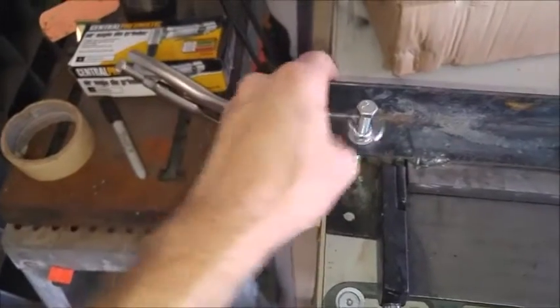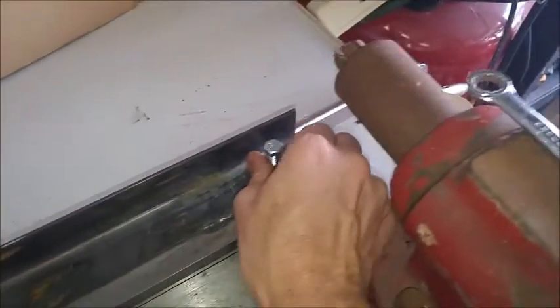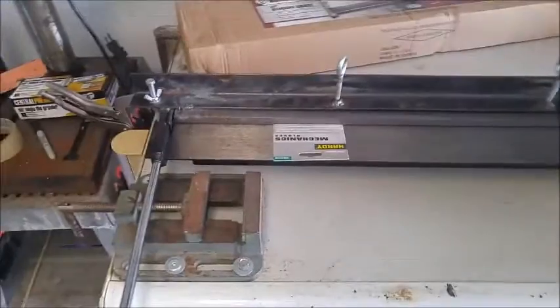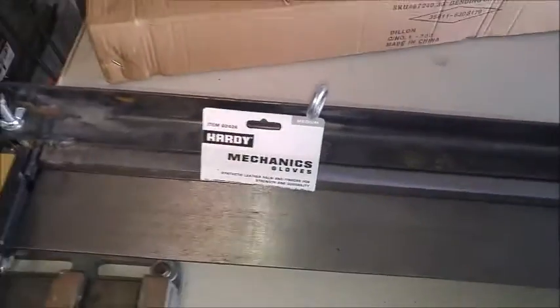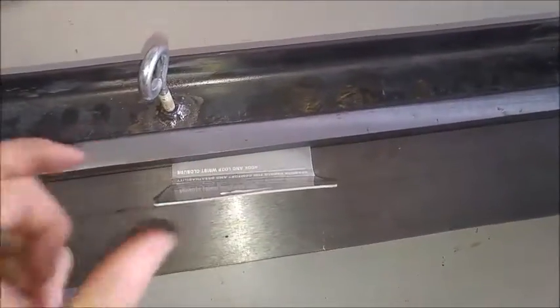Now you bring this wing nut down. Tighten that up. Come over here. Tighten this up. Alright, and then we just give this a little bit of a snug. And that sets everything. Now, just bend that up. Say that's a piece of metal. There we go. We got our bend. Now, to release, you just unscrew this, lift this up, give that a couple turns, and you can get your metal out. And then you can reset wherever you want.